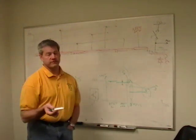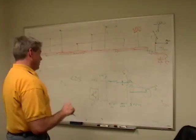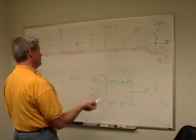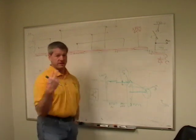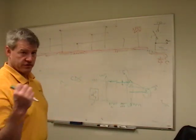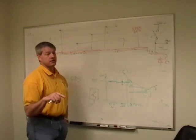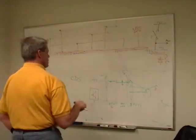It also gets rid of some of your flicker noise. It does amazing things. It's practically magic. You pay for it in the hardware. You have to have extra hardware. If you're doing it purely in the digital domain, you've got to have two analog to digital converters, and you're going to have double the data rate coming into your device, depending on whether you do the subtraction there. You can do it in the analog domain. It's less hardware, but it's still more hardware.